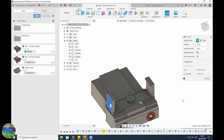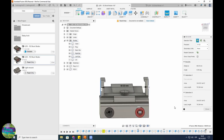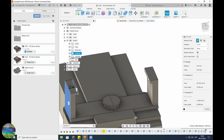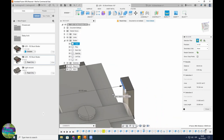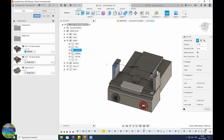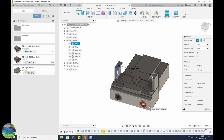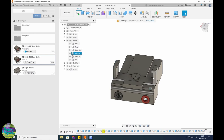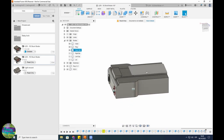It has a clamp underneath. The clamp works by putting a rubber band around this area — you can pull the parts apart and the rubber tension holds it. The sliding parts are angled so it can't fall out easily. This should give you about 10 centimeters of holding power, and it's about 5 or 6 centimeters from side to side at a minimum clamping distance. If you have a really small multimeter this maybe doesn't work, but 6 centimeters should be okay for most multimeters. I made it in 4 parts — 2 equal halves plus a separate back bracket to hold the sliding clamp parts. This way you can choose which direction you want the clamps.